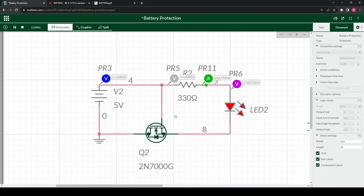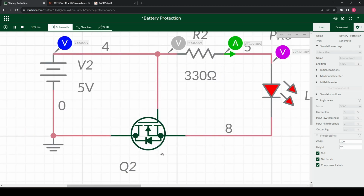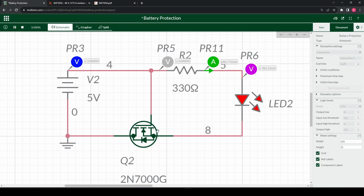Now, it may be all good, but the problem with this circuit is that it's on the low side, and this means we'll experience a small voltage drop across here, which can affect the rest of our circuit if we're not careful. Whilst N-channels are fairly decent, I believe certain RDS(on) characteristics perform better or worse, I cannot remember now. Though, just the fact of experiencing a small voltage drop across the ground may skew our results. We're not really willing to do that.